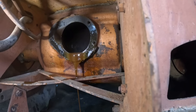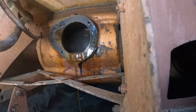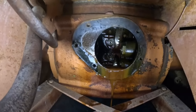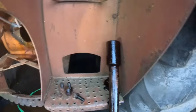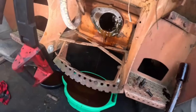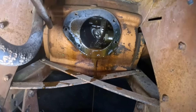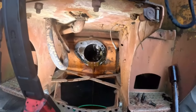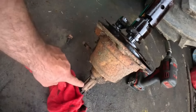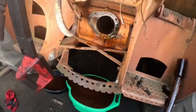I'm really surprised that more than that didn't drain out of there already. You can see in there — there's a reflection, looks like there's two shafts but there's only one. This shaft here has splines like a PTO shaft, you know, like a 540. So this will go in there and that's what drives it. This tractor doesn't have live power, so if the clutch is engaged, that is moving. You can disengage the PTO output side here by this lever right here.